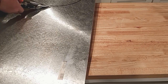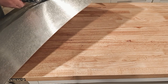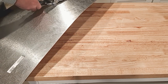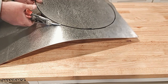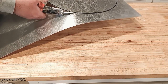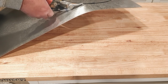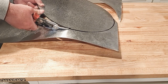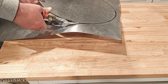We're using really thin gauge here — I think it's 1/16th of an inch, might even be 1/32nd, you can check the tag. Try not to knock off the marker with your hand while cutting. Keep your fingers away as much as possible and always leave the center marking there — you've got three holes that have to go in for the all-threads. You can see the marker going inward at one point where it wasn't tight, which is why cutting on the outside is probably a good thing here.